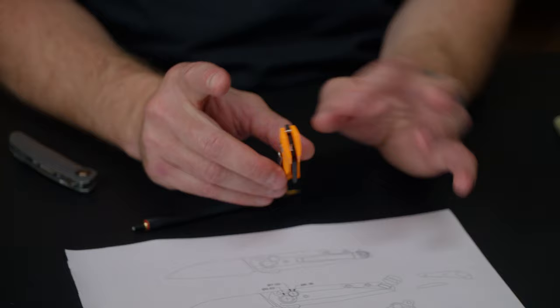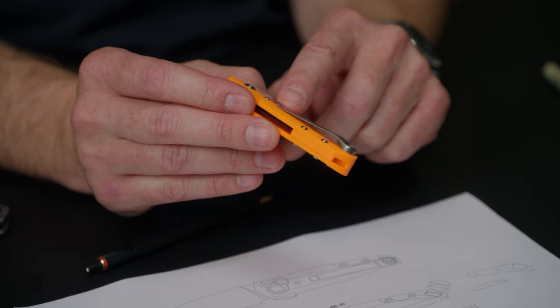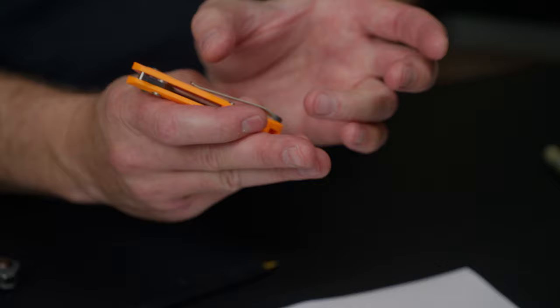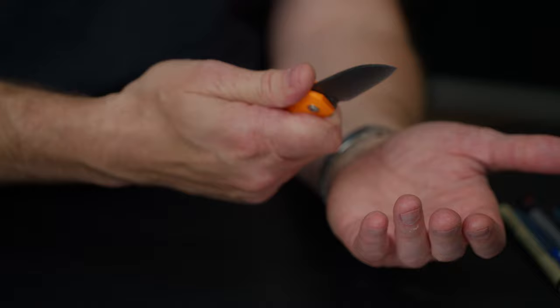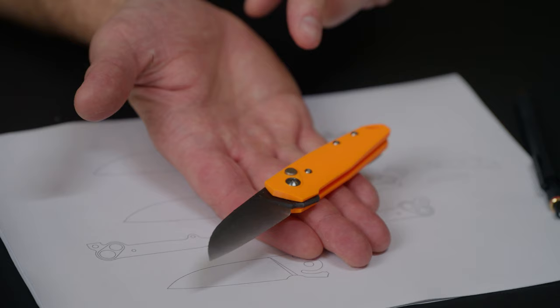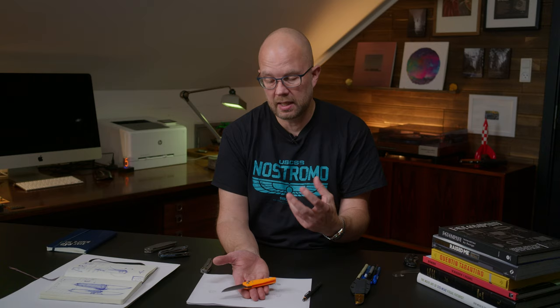While this is not fully functioning with the flipper tab and everything, it still opens and closes, I can attach the clip. I could see that the clip was actually not working as well in the physical form from a size standpoint, so I wanted to make it shorter than on the Isola. I could start seeing all the details in hand, feel it, imagine how it would feel using for cutting but also how the mechanism would work. That's where 3D printing really helps speed up the process — from this point on I have something where I can decide whether the ergonomics are exactly like I wanted or if it needs any changes.